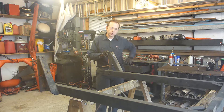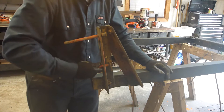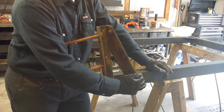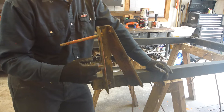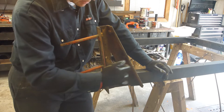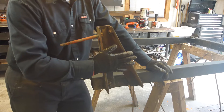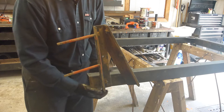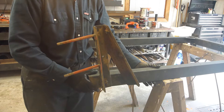Hopefully these ROPS will be able to provide protection if anything happens. It's possible this one could have some resistance, I'm not quite sure. So I'm going to make modifications and do some painting before I reassemble. From another point of view, you can see the half-inch bolts — they could not be removed because this section was added later, so I have to cut these bolts, enlarge the holes, beef up the material, do some gusseting, and add material at the back.